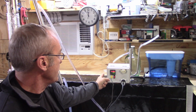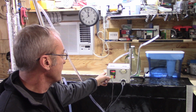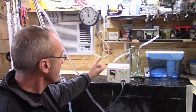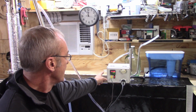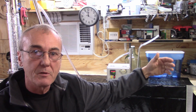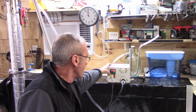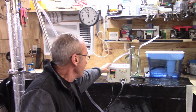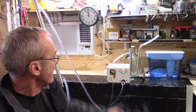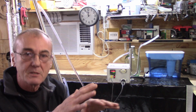I wish I could have caught this just a little bit earlier, but my PID, as I described about it fluctuating, is already tuned in because the auto-tune light went off. It was at 87 degrees, probably about 5 minutes ago. It shot past 110, went up to 135, and then, of course, it shut off. Now I'll show you. See, it's working at 12% power. Look, off, 0. So it knows where it's at, and see, it's trying to balance itself at 110 degrees. Now I'm going to let that sit there for a little while until it balances out.